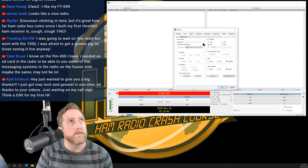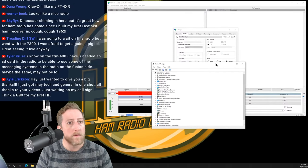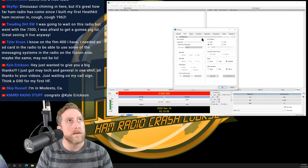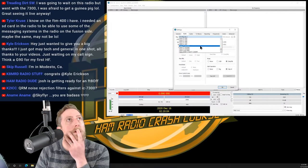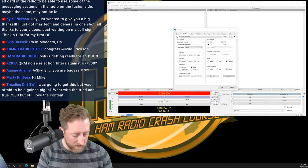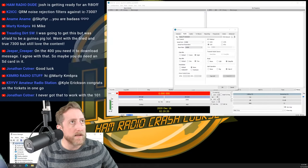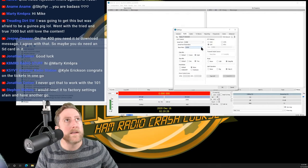Okay, we are ports. It is these guys, 8 and COM 10, so we're going to start with 8. It is going to be a Yaesu. I'm gonna try to throw the FTDX 101D at it and see what it does. Was it 8? Did I get the 8 or the 6? We'll see. 8 or 10. That was not what I wanted you to do. 8, and what did it say? It was 38. Remember, we did that. So I'm going to go 8. I'm going to go data bits 8, stop bits 1, none on the handshake. And?